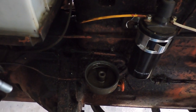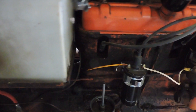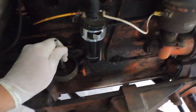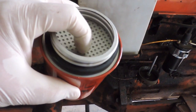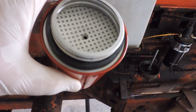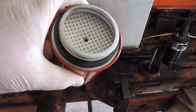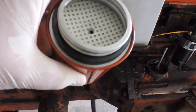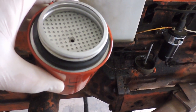I know that if I can fit it down in here as tight as it needs to be, there should still be a little bit of a gap at the top of the filter, so hopefully that should work. The tube is in about as far as it can go. Now, one thing recommended in the manual before putting this on is to put about a teaspoon of oil right here before you slide it on. The manual also recommends you don't just spin it on — you push down gently and rock it back and forth until you make contact with the threads, then spin it the rest of the way. So I've just got to put a little oil right here and then slide it down over.